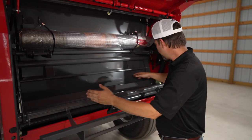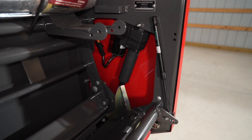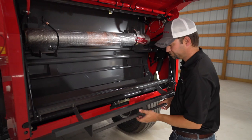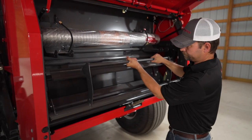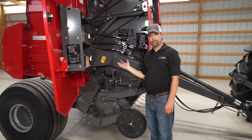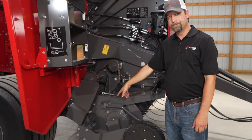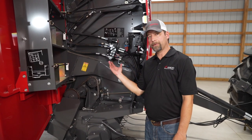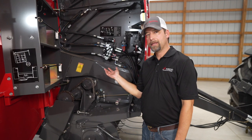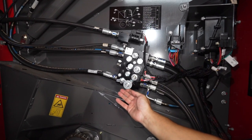You can adjust your width here if you're using a 48-inch or a 51-inch mesh. You can also adjust with these gas shocks on both sides of your tensioning system. The right-hand side of the baler is just as simple as the left-hand side. You've got your drives here for your pickup. A good tip for storing your baler during the off season is to remove the belt density and belt tension here.